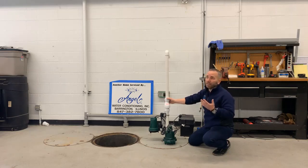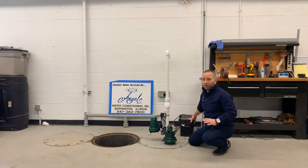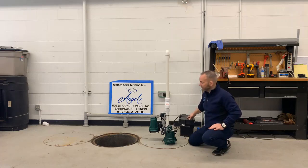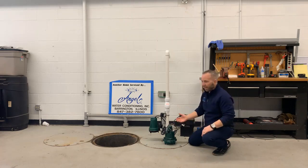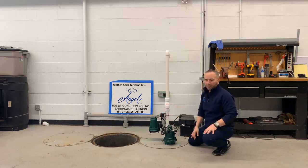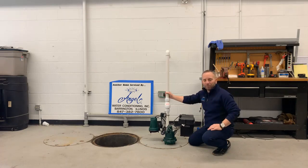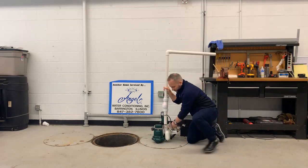We're in about a hundred homes a day and our service techs are taught to check your sump pump, make sure it's working efficiently, and check if you have a battery backup system and verify the battery is good. Marine batteries usually need replacing every three years. Our guys will also check these pumps — we can't tell you how many times we're installing water systems, the softener puts excess water into the sump pump pit, and the plumbers watch to see if the pump turns on. Sometimes they just hit the pipe and it kicks on because the float valve is stuck.